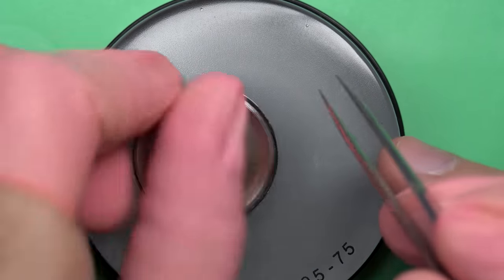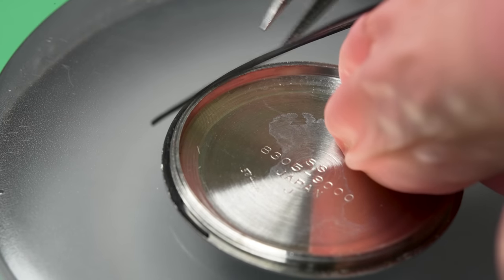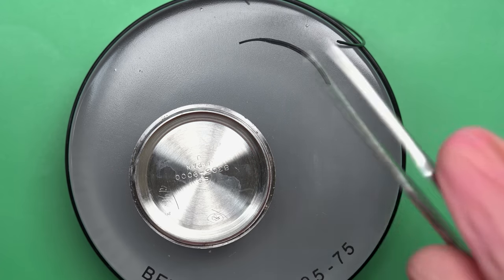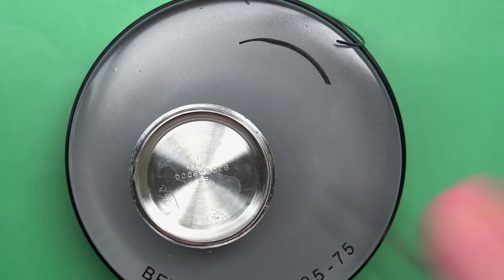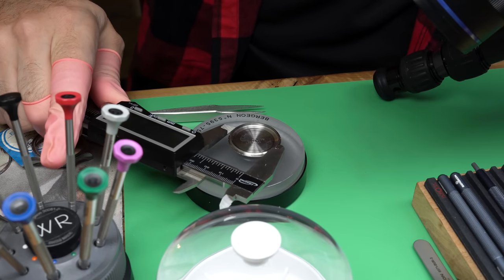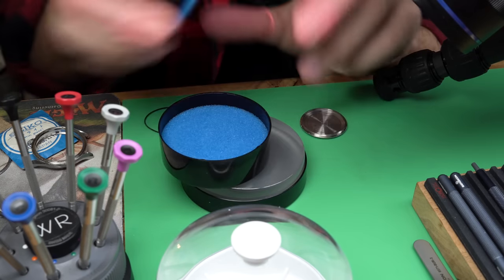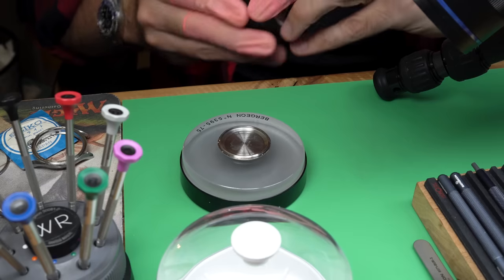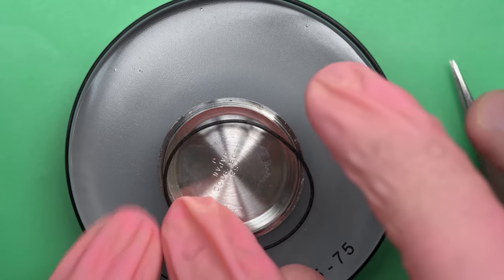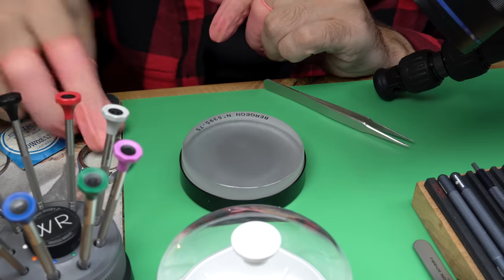I can pour my attention back into the case. The first thing is there is an old gasket on this — it was originally a rubber or nitrile gasket, but look at it now: it looks like hard plastic because it's so dried out and old. So we're going to need to replace that gasket so that if Mikey takes it out in the rain, it's not going to leak. I take calipers and measure it, then I've got a box of gaskets of varying sizes, thicknesses, and diameters. I'll pick the one that matches up closely enough, put it in my silicone coating case, and put the new gasket on — done deal.